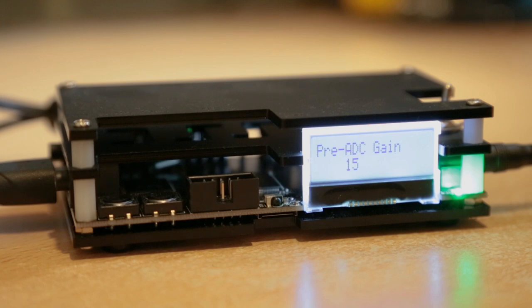It is important to note that unless you save these settings, they will be lost when you turn off the OSSC. To save the settings, navigate one level up in the menu by pressing the back button. Now scroll through the menu using the next button until you get to settings option. Enter this using the OK button. And if you're not already on the save profile, navigate up or down through the menu using the next or previous buttons. Once on the save profile screen, it's just a case of using the left or right arrow on the remote control to choose a location that you would wish to save these settings to, and then press the OK button to save. Exit from the menu using the back button, and the back button again. If you wish to turn off the LCD backlight, this can be done using the LCD backlight off on button on the remote control.